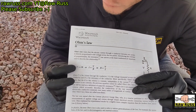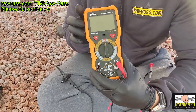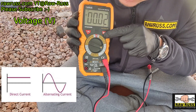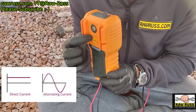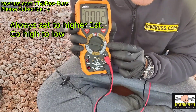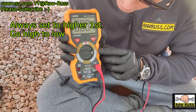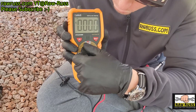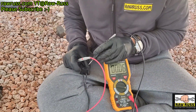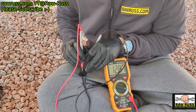Turn the power back on. Basic Ohm's Law: if you have two figures, you can figure out the other one. What I'm doing is testing for voltage here. So I get my multimeter and set it to voltage. The squiggly line means it's AC; the straight line means it's DC. You've got to set the correct number because there's a fuse in here that you can blow out — worst case scenario, you blow out the whole multimeter. So we set it to 60 because that's higher than 12, which is what I think it is. If you were testing the voltage in your house, you'd use 600 because it's going to be around 120. Always use a setting higher than what you're measuring. We take our leads, place them inside at the contact points, and basically we get 12.8 volts. That's good — that's what we wanted.